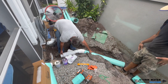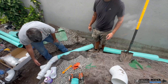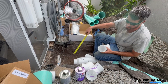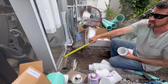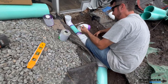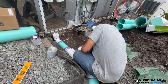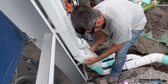Miguel's helping me install this 6-inch main going to our hub. This central hub is going to connect all of the 4-inch laterals that grab the two downspouts as well as the deck drain. Whenever you're installing PVC, there is no flex — it's a rigid pipe, you cannot bend it. So you need to measure twice, cut once, and make sure everything is lined up correctly, because if it's even a little off when you solvent weld, it will throw off the rest of the run.